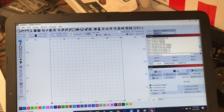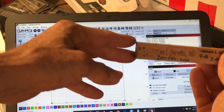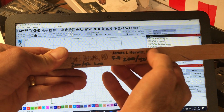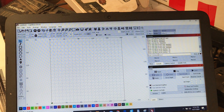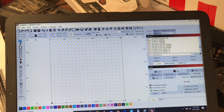There are two modes you'll use for engraving. One is line mode, where you're just doing outlines — that's fairly quick. The other is raster mode, also called fill mode, which is a lot slower but that's how you get solid writing or solid shapes. This sample here was done with fill mode.